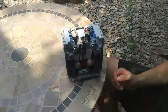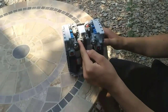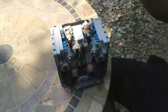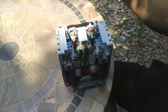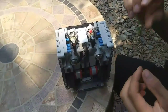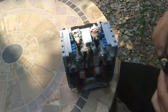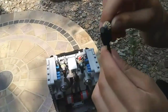When you're designing a very compact robot, oftentimes you want to put your motors one way to make it fit better, but you don't want your attachments to connect to them in that same direction. So you have to gear it in some way that gets the power to where you want the motors to connect to the attachments. In past years we've had a lot of problems with this because often when you gear things, you can't get enough torque through it — if you put too much pressure on them, they start to slip. How we fix that is we use these pieces which hold them together really well, and we haven't found that they can slip at all.